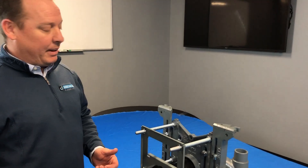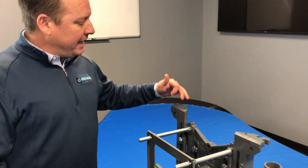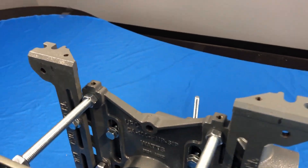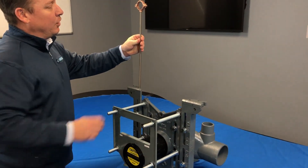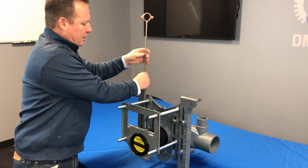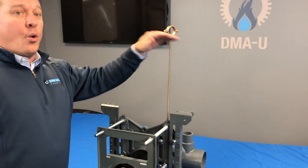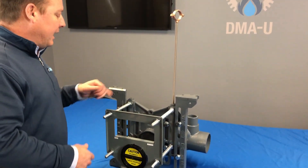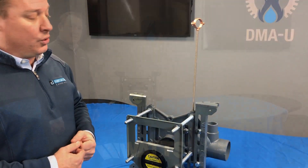One of the last features I like to talk about — I think Watts really did a great job listening to contractors — was adding four different 3/8" taps to the top of this carrier unit. What that does is give you the advantage of taking a standard 3/8" rod, screwing it in with a split ring hanger, and getting the perfect adjustment to bring your flush valve out. It also gives you features where if you want to move it over, you can use it for your header water going across. With every carrier you're going to have to have some sort of water supply and a flush valve, so adding these four taps gives you a lot of advantage on speed to get this thing installed correctly.